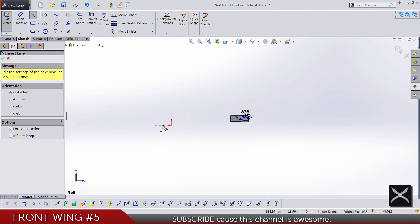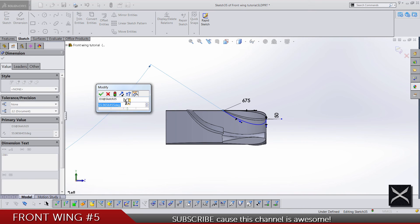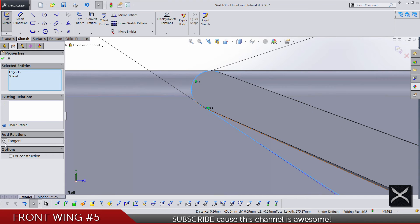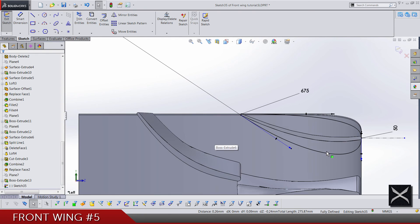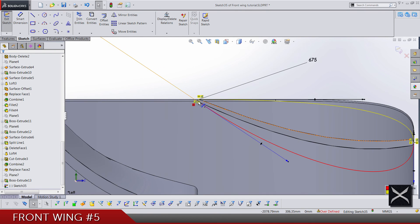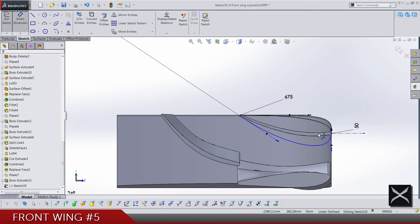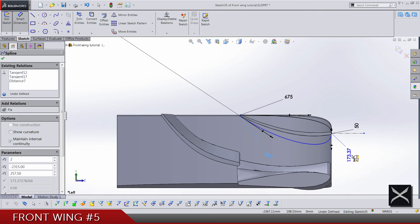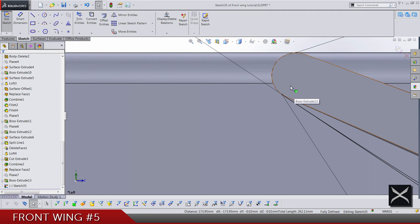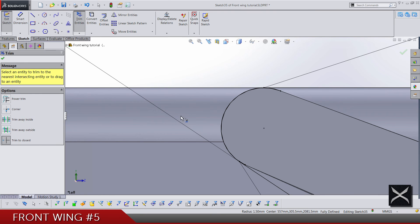We need one center line that's going to be vertical going from the origin, to add the angle between that one and this handle — so we have 55 degrees. Make sure that the spline and the circle edge are tangent. The distance for this one is 300... we're having some problems. Let's try deleting the tangent relation, then first set the distance: 380. The right one is 130. Now let's bring back the tangency.